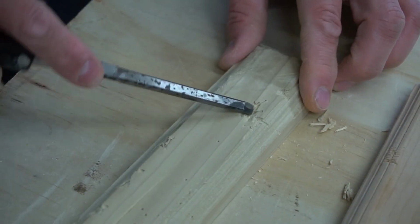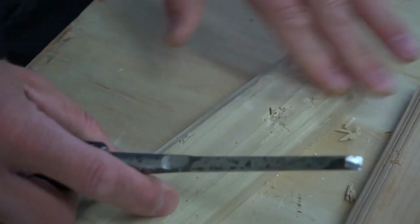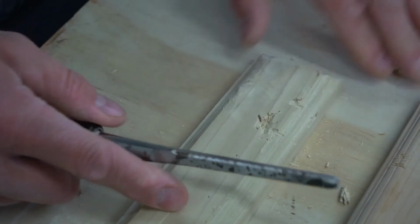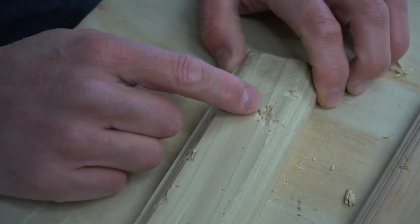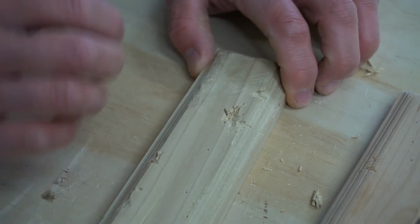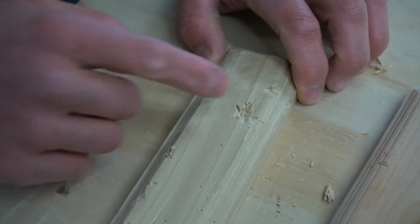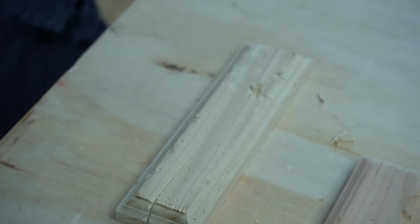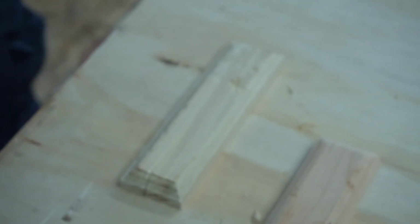I know that doesn't look exactly like a knot right now because of the color variation, but once you dip that in some stain, get some stain on there, that stain will sit in there and darken up that color, because it's newly exposed wood, and it also likes to sit in those darker areas or those deeper areas and darken up. So the last thing we're going to do is run the sander over it, and I'll show you how that looks in just a minute.